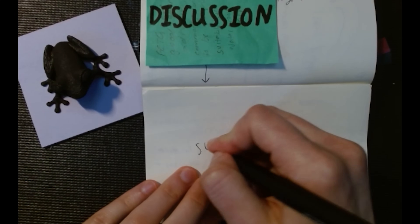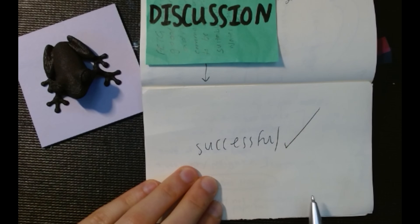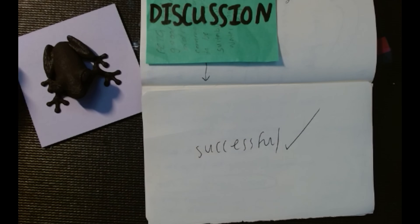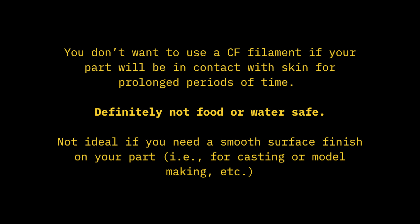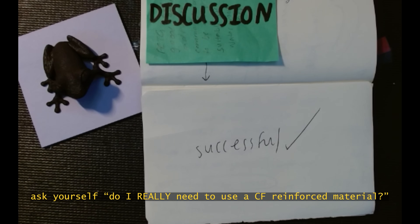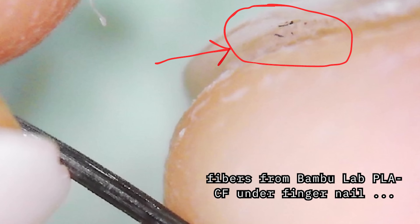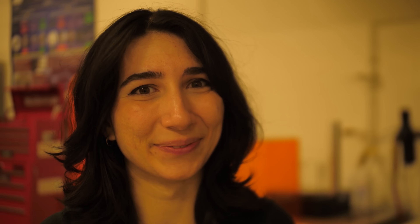All in all, I would say this was a successful visual analysis. It definitely put some things into light in terms of the fiber transfer from carbon fiber filled materials — this is a material you have to really be considerate of. When working on a project where you're considering using a carbon fiber filament, compare the mechanical properties of the non-fiber-filled version to the fiber-filled one and see if the slight improvements are even relevant to your application. And of course, be mindful of what you're touching during and after handling carbon fiber filaments, especially after realizing what the fiber transfer is like from both the raw filament and the prints after extrusion. Alright, that basically wraps it all up. Thank you for watching and I'll catch you in the next one.